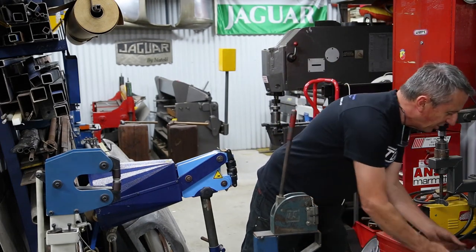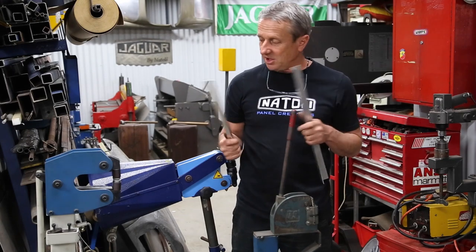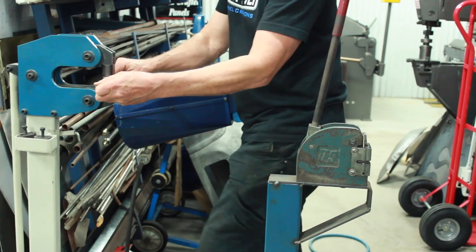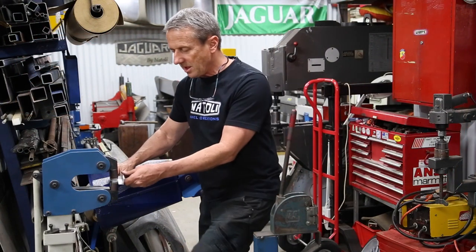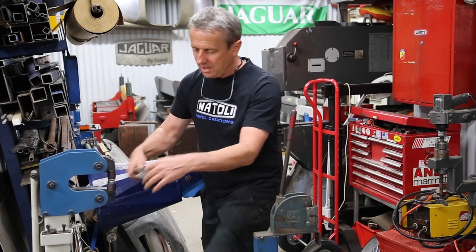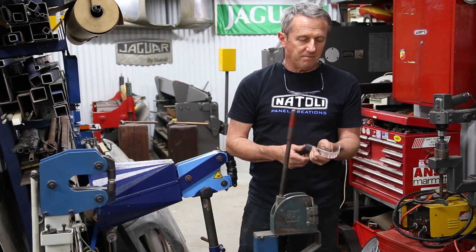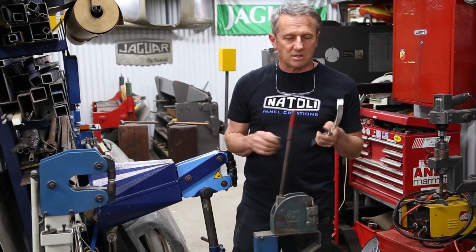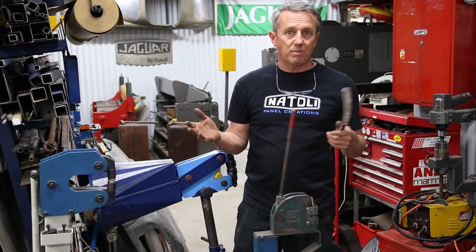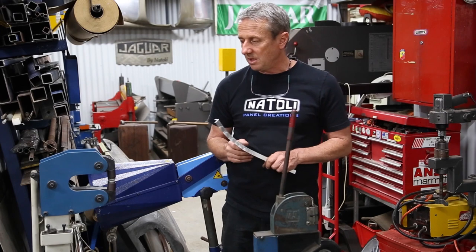So the idea of compound curves — sometimes you might want to make the shape of a panel or get a copy of a profile. You can actually use these to get a compound curve. You use it in one direction and then turn it sideways and use it the other way, which gives you a whole different profile. This can also be for an inner edge of a mudguard or something like that. That can be good as a pattern — it gives you a three-dimensional pattern. I use it for doing big panels. You can buy yourself some noodle gauges or shaping gauges, but you can still get a fairly accurate full compound curve using this technique.